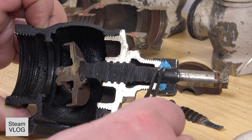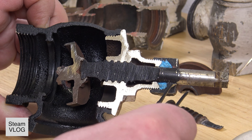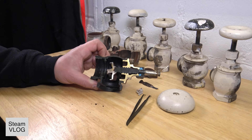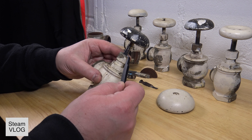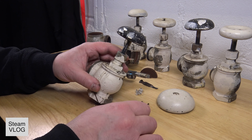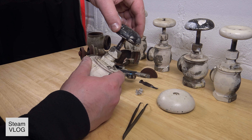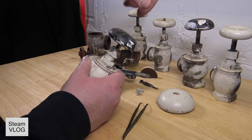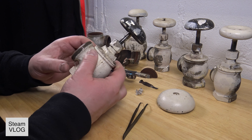That's why you have what is marked in blue here — a so-called packing. If your valve leaks up here and there is water coming out, that's because the packing underneath this nut is bad. You can notice this on this one here — it moves a lot and twists in and out very easily. I can promise you 100% that the valve packing here is not working anymore.